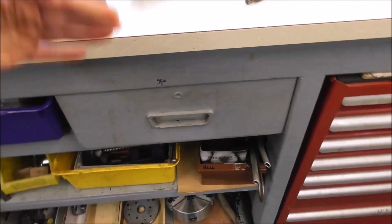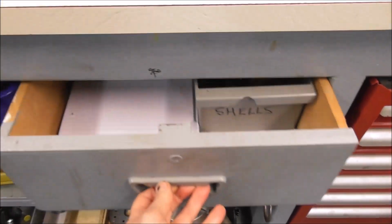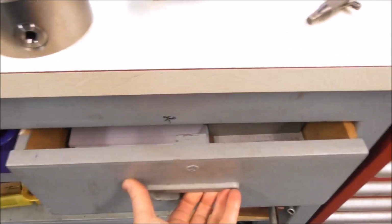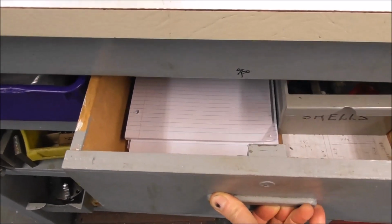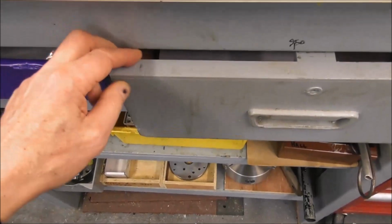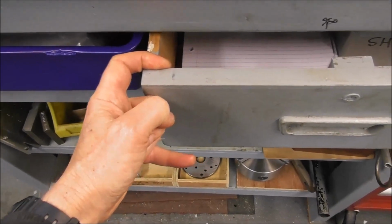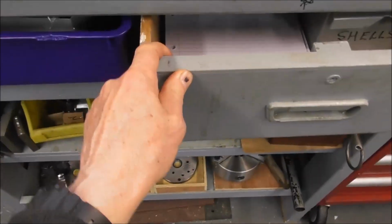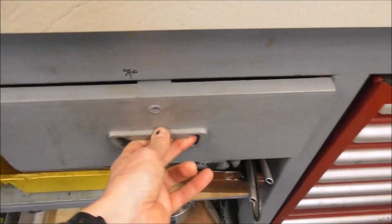So on a drawer there's a ratio here between the depth or the length of the slide and the width of the slide, and if it's very wide with very little depth of engagement, you get what I call racking. Let's have a look at this. So it racks one way and the other way. I don't know if that's showing up very clearly, but effectively if you pull on one side down the edge here, rather than sliding, it racks over and jams. If I pull in the middle, it slides freely, but it'll rack and jam over to one side because the length of engagement relative to the width of engagement is very poor.